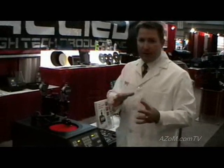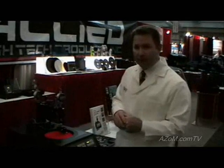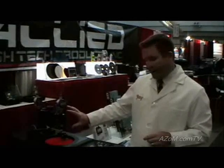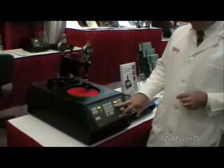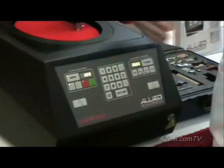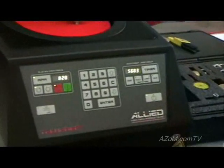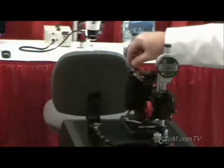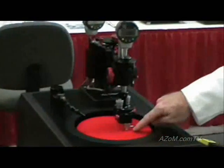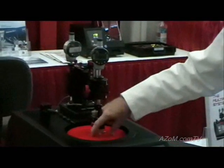Clockwise or counter-clockwise rotation of the platen allows you to change the direction of the wheel. The movement of the multi-prep itself is controlled at the control panel where we have an oscillation function. The oscillation allows you to move the arm back and forth, where the stroke — the distance that it travels — is controlled through the adjustment of two screws. For example, the oscillation stroke is currently occurring in about the middle of the platen, which is not ideal.